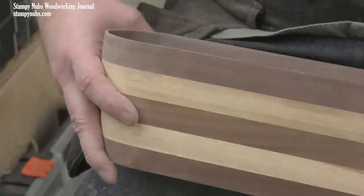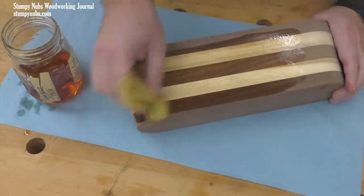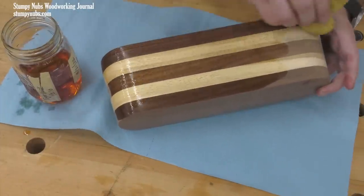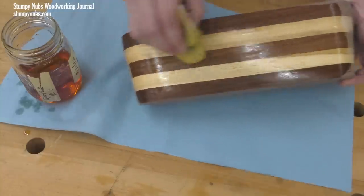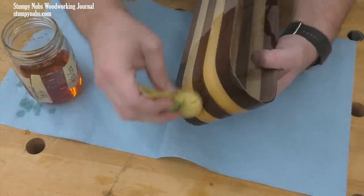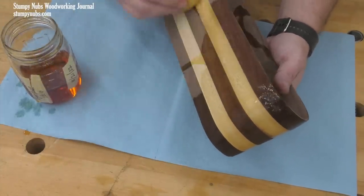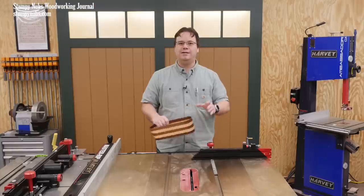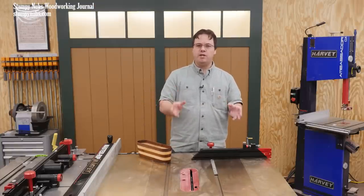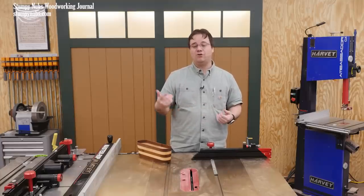I like to sand the outside up to about 320 grit, then put on a few coats of my favorite finish. Here I'm using shellac, which is food safe. Really any finish is food safe once it's fully cured, even polyurethane. But shellac is a good choice here because it's easy to apply and it produces a nice gloss that won't dull over time like boiled linseed or mineral oil. I have a tutorial about using shellac if you haven't used it before — I'll link to that below. Be sure to check out that 3M sander or at least their Extract sandpaper; that is the best sandpaper I've ever used, hands down. These things have really been game changers in my shop, and if you use the link below you'll be supporting me and a great family business. See you next time.